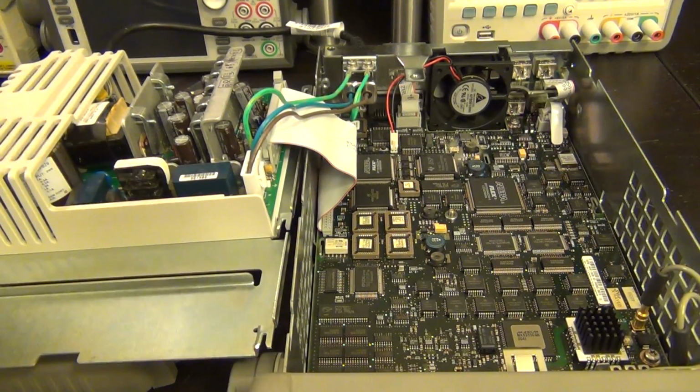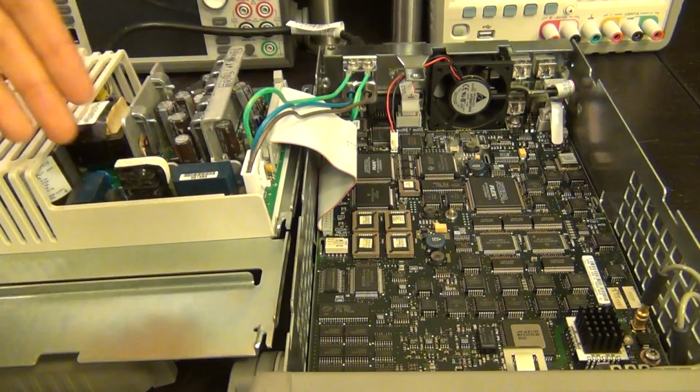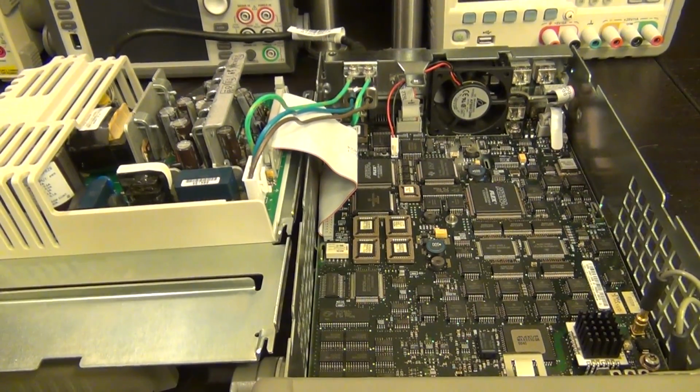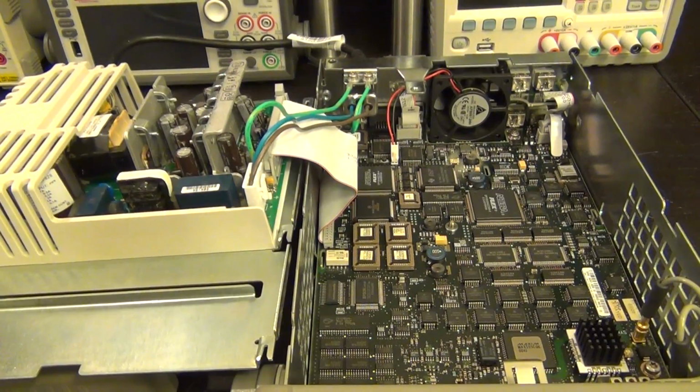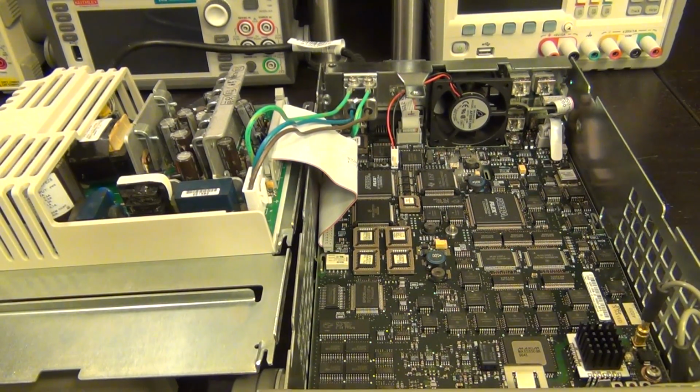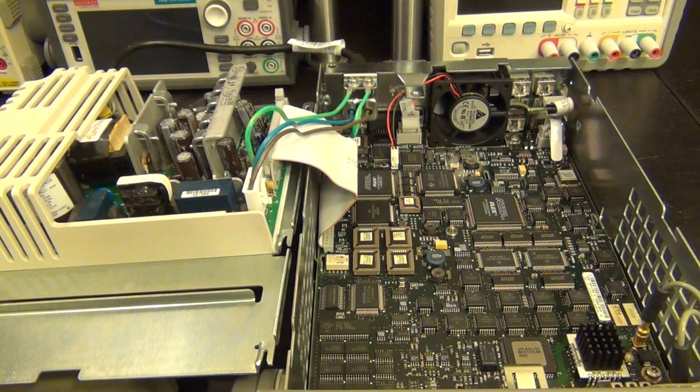So yeah, obviously some signal, at least some voltage, is getting into the power supply itself. So we can go ahead and probe that later. But before I do that, let me just quickly show you the schematic portion of where the switch is responsible for turning on the unit. That would be a good place to start, and we can also investigate some other features. And don't worry, I'll give you a quick look at the motherboard afterwards with all the different ICs on it. But let's focus on fixing it first.